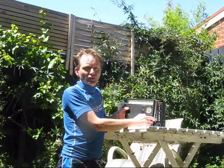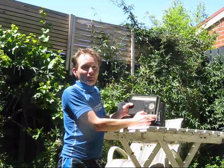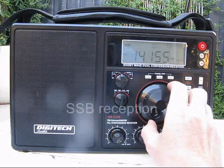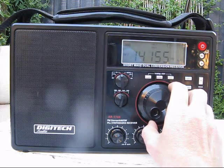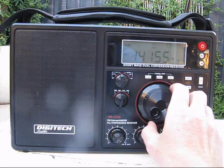The little National is definitely the better radio on 160m AM, so I'm certainly not going to discard this one. And a reminder: this radio does not have a BFO fitted. External units are available and you sometimes see them on eBay — designed for the AR1747, they'll also work with this set.